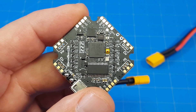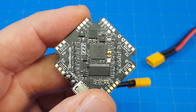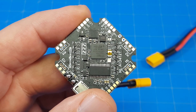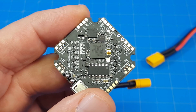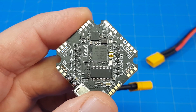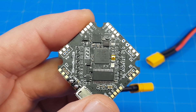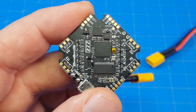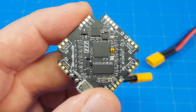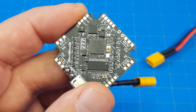It's using the MPU6000 gyro, so it's not super sensitive to vibrations. It can handle up to 4S. The amp rating is up to 12 amp, and 15 amp is burst — burst is not detailed as to how long a burst or peak is; I suspect that's just a moment or two. DShot 600 is installed by default, but you probably should be able to run higher than that — you can experiment with that.